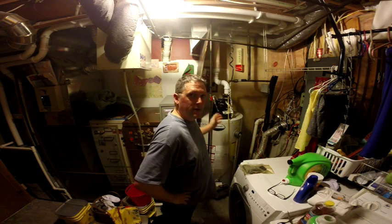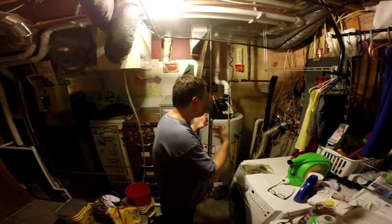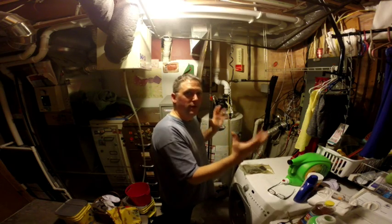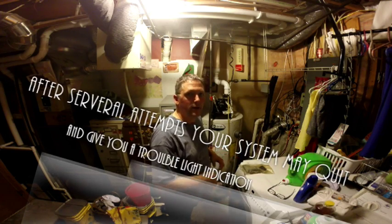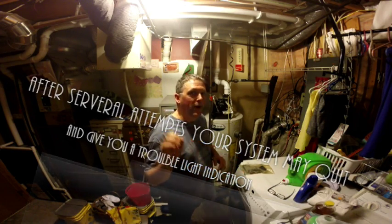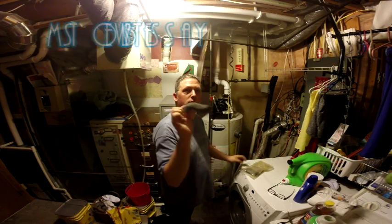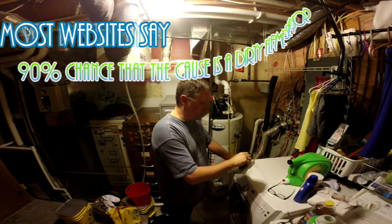You are watching this video because your water heater will not light. It starts up, it runs, and then the flame goes out within seconds. Then it cycles again — it starts up, the flame lights up, and it shuts the gas off and shuts the flame off again. That could cycle all night long. That means you possibly have a flame sensor that simply needs to be sanded with a little steel wool.